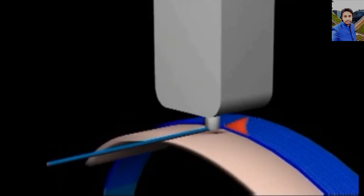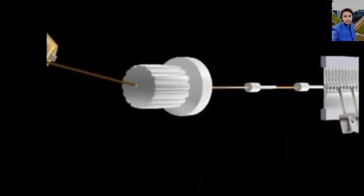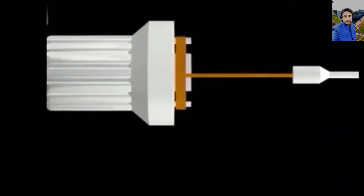When the measuring drum stopper pin releases, weft from the measuring drum is unwound. Air, supplied by the tandem nozzles, pulls the weft from the measuring drum for each color.